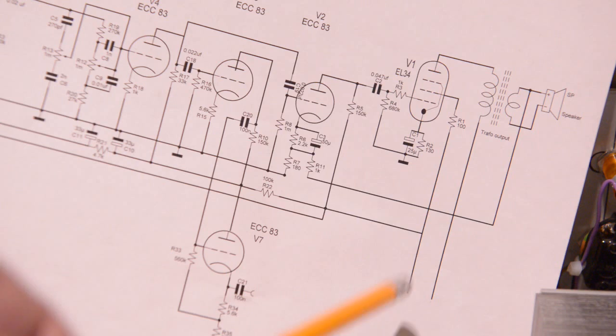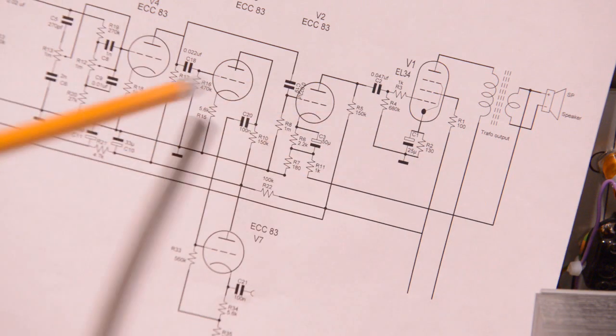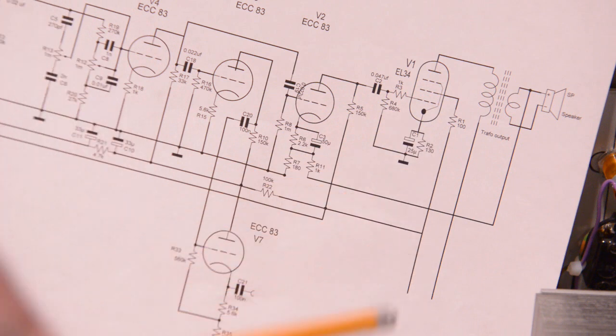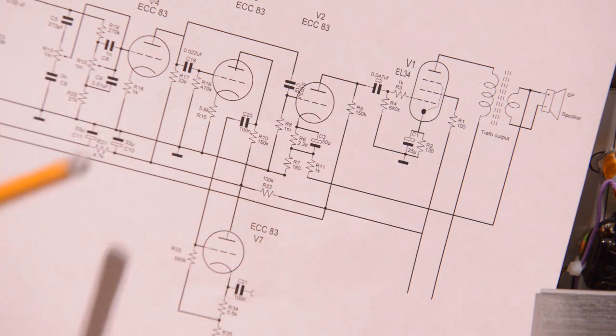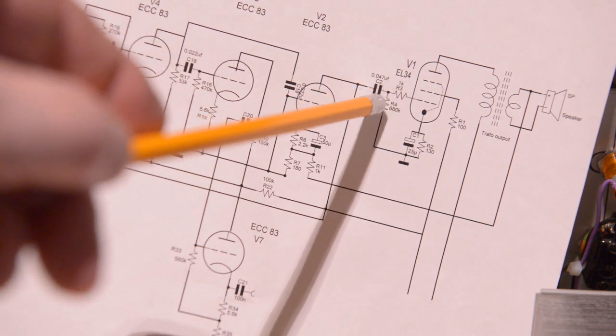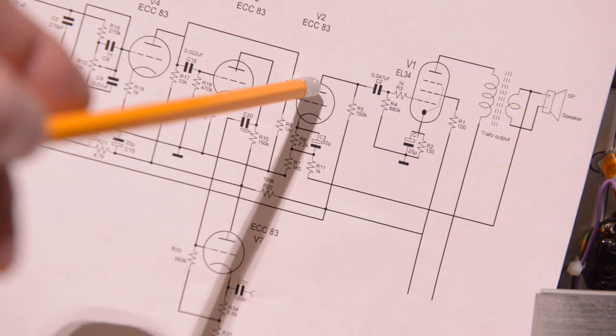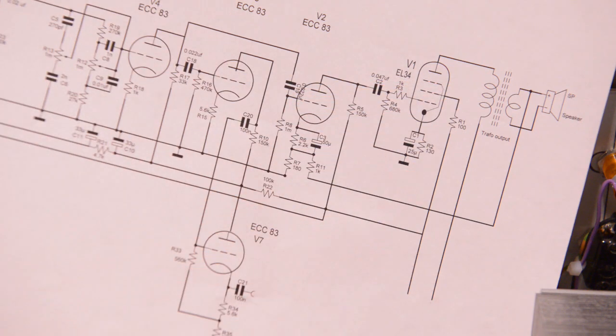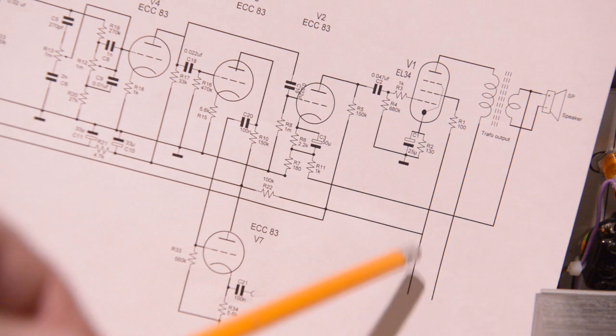So you have to see this double. So this side goes to that same point, and the other side also. So when you got the signal, say from this point, onto the grid, then you had automatically, because of that, also a feed down there. So when I put that second choke in, that was gone. Okay, so we had to feed via the screen grid.